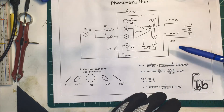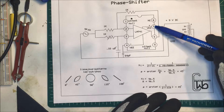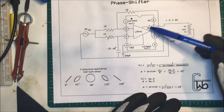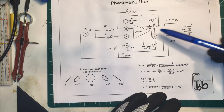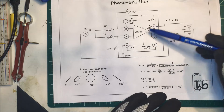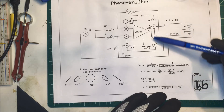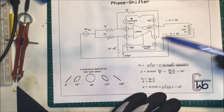What we do need is a voltage rail — positive and negative voltage. These yellow 741s will work with just a positive and a ground, like on my power supply which just has a positive and negative where the negative is just ground. But the output won't go below zero — it'll be all positive — so you won't get a sine wave out of it. You need to have a positive-negative rail.